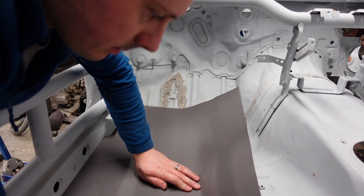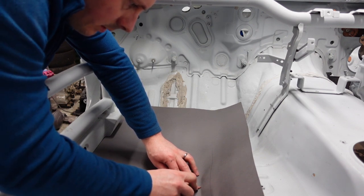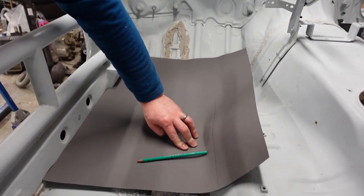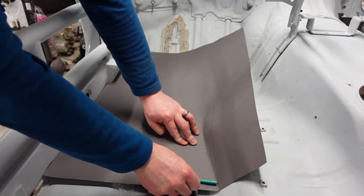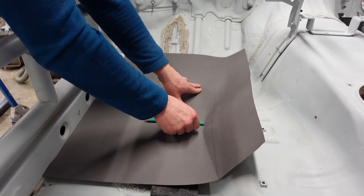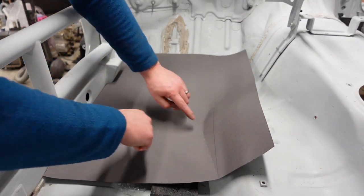What we need to do now is take some other points. I use the pencil as a flat edge because it sits flat on the tile, and then I'll just mark that out there. You can see it goes to my original line, so now I've got that contour which should meet lovely against this raised part — as long as nothing moves. We should be able to get an idea, so I'm going to cut this bit first and then we can work out where we are, get a bit closer and nip that off.